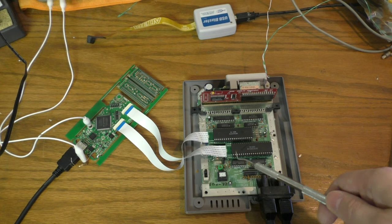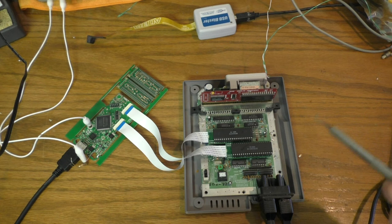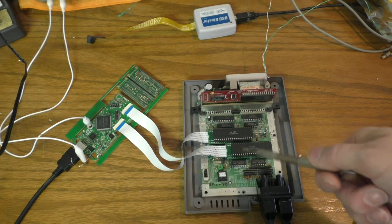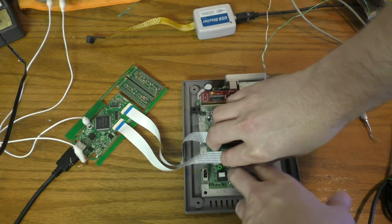And this way we can tap the signals between the system motherboard and the chip, and the CPU and PPU both need one, unfortunately, unlike the RGB NES, which only does video, but since I'm reading the controllers and all that other stuff, I really have to tap both of them. And then this also has a copy NES add-on circuit underneath here. So if I turn this off, and then if I take these off, you can actually see that. So here's what it looks like underneath.